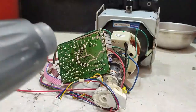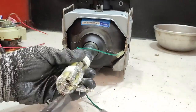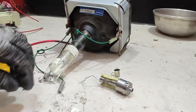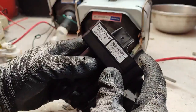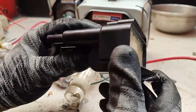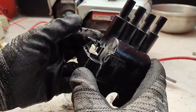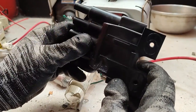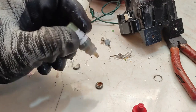To open the CRT tube, I first detached the PCB using a heating gun and then broke the tube. After opening it, I realized there are no internal capacitors. I did the same for all three CRT tubes but found nothing. After checking more components from the TV, I found a terminal for high-voltage dividing which has an internal capacitor — probably a mica-aluminum capacitor rated for 35 kilovolts and 300 picofarads.